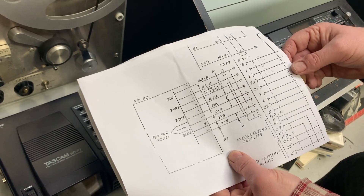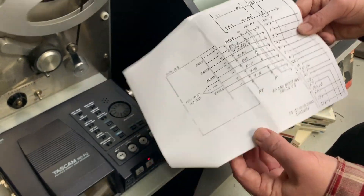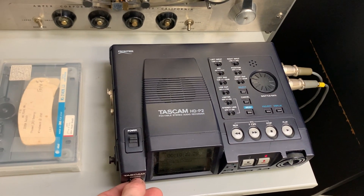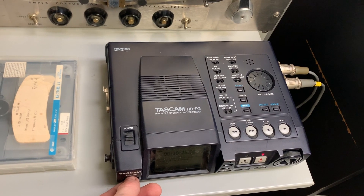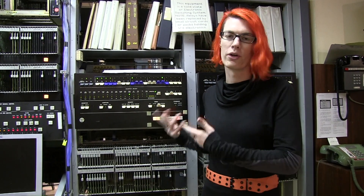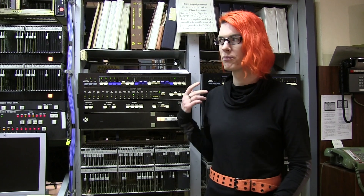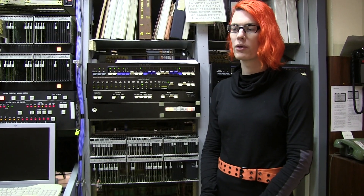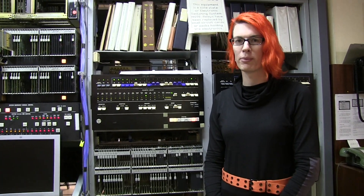It's sort of like playing back a pre-recorded quarter-track tape back in 1974. By 2019, this project had gotten sufficiently advanced to a point where our volunteer Chuck, who'd been working on maintaining the processors, had gotten them functioning and worked out enough bugs — there are some stuck gates and stuck bits in the memory. Our other volunteer Colin had built a replacement tape drive so we could plug it in and pretend to be a tape transport with the tape in it. So far, we've gotten it to the point where you can see that it's running code. This Cylons pattern is what the second-stage bootloader puts on the display buffer to indicate that it's running successfully.